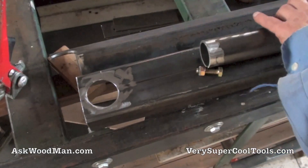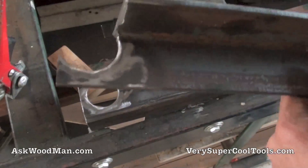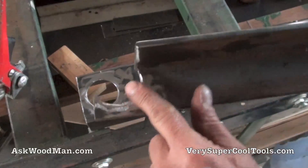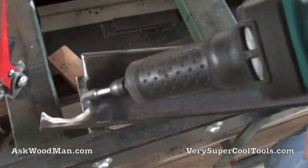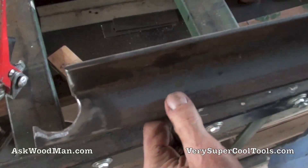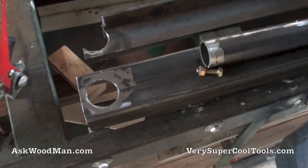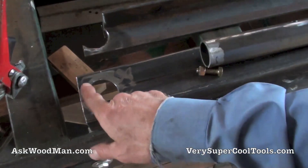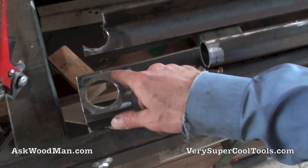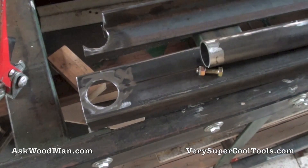I don't want to lose that bolt. You can see I'm going to weld on the inside here, and I've got the bevel all cleaned. I did that with the die grinder and one of these burrs — it just cuts metal like crazy. It's hard to get in there with a traditional angle grinder. That's all ready to go, and I wire brushed and used the grinder to make sure all the contamination near the weld is cleared, so that grease, oil, and slag don't bubble up, vaporize, and get trapped in my weld — which makes for a weaker weld and can cause porosity.